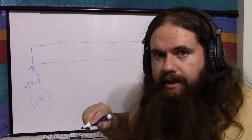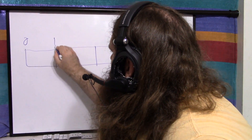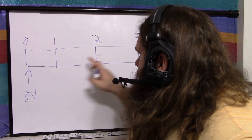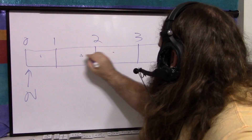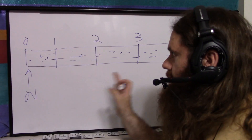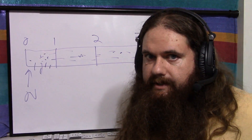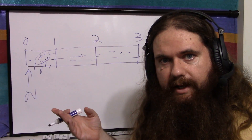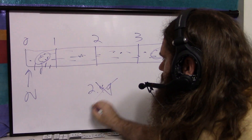What does 0 to 1023 actually mean? Let's say you only have 2-bit resolution — that's 4 buckets: 0, 1, 2, and 3, where 0 volts is the bottom and AREF is the top. When you call analogRead, you get 0, 1, 2, or 3. The voltage can be anywhere in each range — it gets rounded down into a bucket. All voltages in the lowest range will be listed as 0; all in the highest as 3. It's a linear scale with truncation. You could have 2.49 but you only get the integer 2.